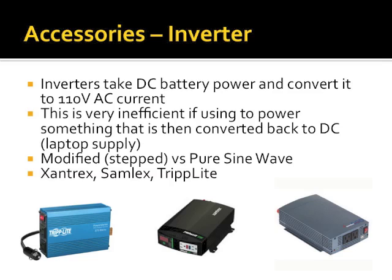Do not plug in your ham radio switching power supply. Do not switch from 12 volts to 110 into your power supply to step back down to 12. I have seen people do this. Actually drag their little Samlex 1223 out with them, or their Astron or whatever, and not just run the radio off of batteries. Don't do that. You guys are all smarter than that.